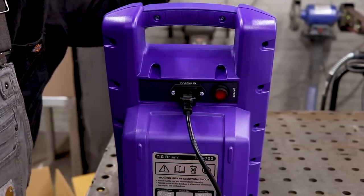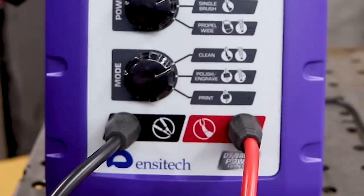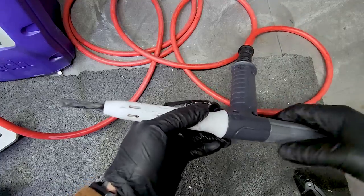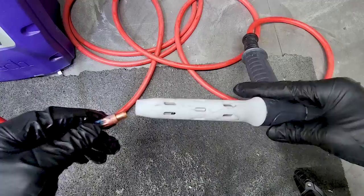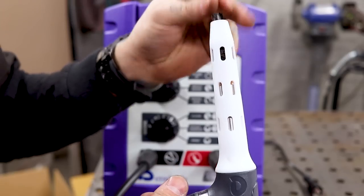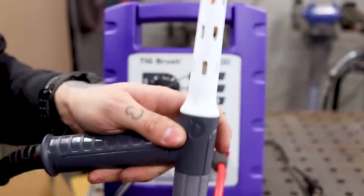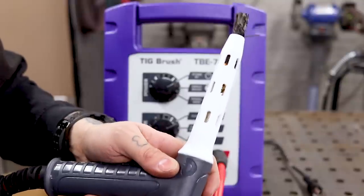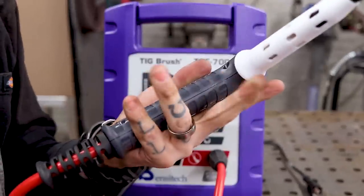Just plug our power cable in — we have an on and off switch. I love the simplicity. It shows how to set up the ground clamp and the gun. For setting up the gun, it's really simple. As you're using it, you'll be screwing the back cap to raise the brush. If you need to change it, max out your back screw cap all the way to the top and you'll be able to pull the brush out and pop a brand new one right in. As your brush gets worn a little bit, you can adjust it and bring it out — you don't have to cut or trim anything like you do with some other electro polishers on the market. There's a real ease of use and a nice ergonomic grip, so it's going to be super comfortable.